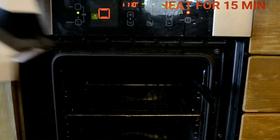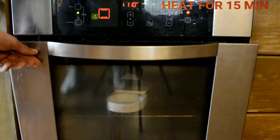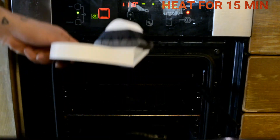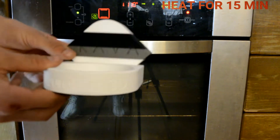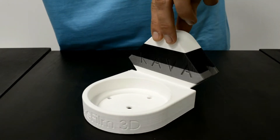To see the real power of PLA Fire plastic, you have to put your printed parts in the oven for 10 to 15 minutes at 100 to 120 degrees Celsius. The material after this temperature process is great for outdoor usage and it is heat and water resistant.